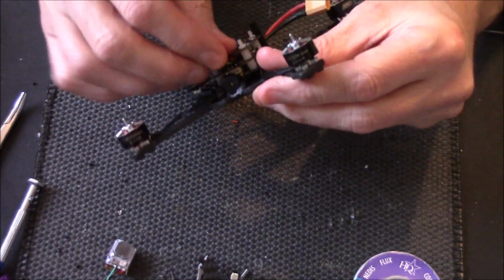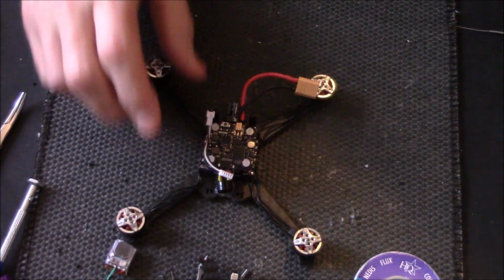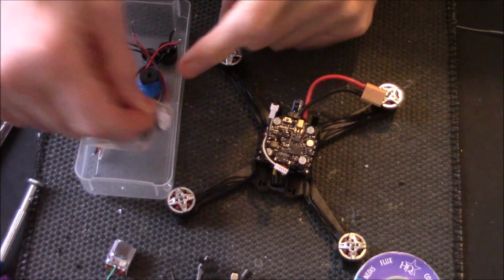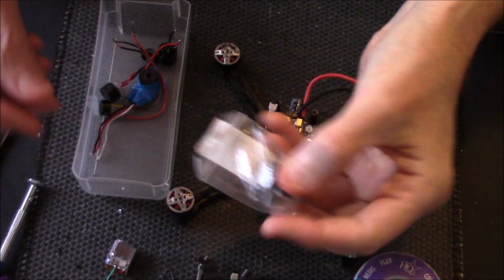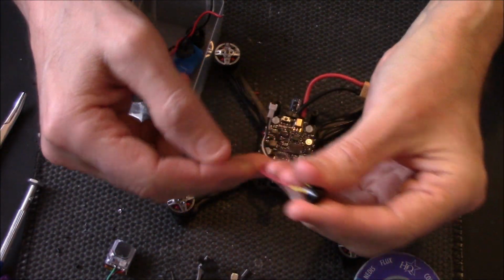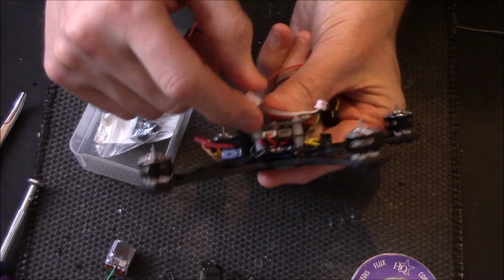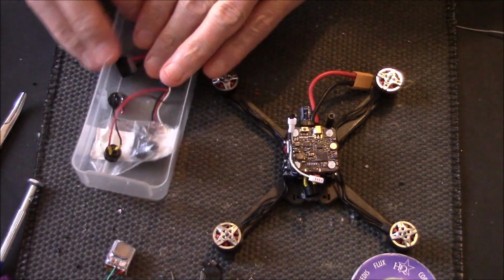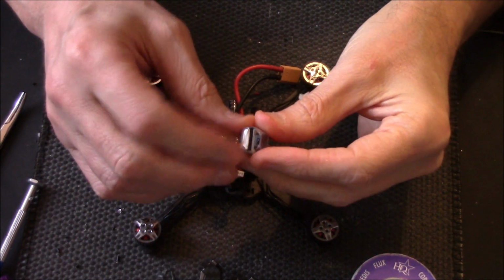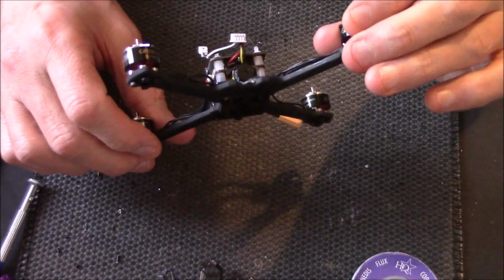So what I've done is I've just got a buzzer, wired it up and plugged it in. I'd already done that off shot. It's as simple as you get a packet of these little buzzers, cheap as chips they are, and all you do is, well, something like that actually, I could have used that one rather than making a new one, just solder red and black to it, and make sure you've got the right JST, the little plug to go into where your buzzer goes. And that's all I've done. Nowadays it's more of an old-fashioned way, because everyone's getting these ones with the battery safes, the little buzzers on, so that if your main battery gets ejected, the buzzer rings off. But we never used to do it that way, so I can't do it that way on this one, so it's no big deal.